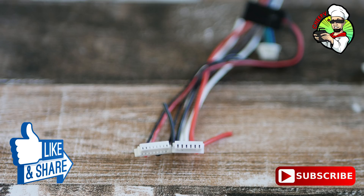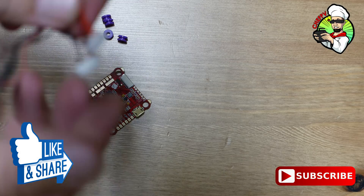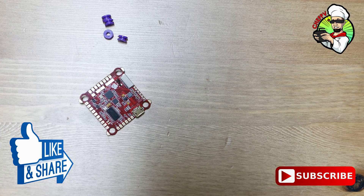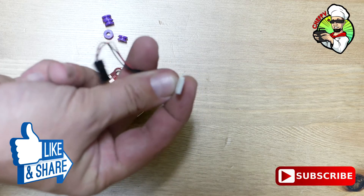On screen you can see these two header pins — they look basically the exact same size. However, one is an 8-pin header and one is a 6-pin header. It's easy to see how if you put the wrong header in, you could actually smash the pins inside the connector and ruin the board. If you use those fat headers and stick them into a smaller header, they'll actually fit physically, but they will not make proper contact and give you a signal. I've already helped myself and another person who had this exact issue — their signal pins were too big, so they were only getting contact on two of the four pins. They had built their own header and used two fat ones. So if you're going to build your own out of your parts bin, make sure you use the right header pins.